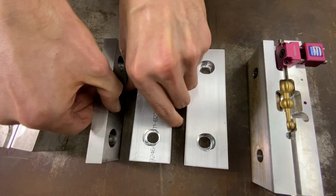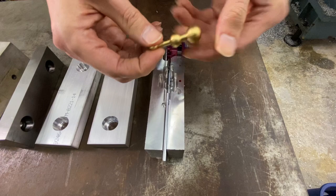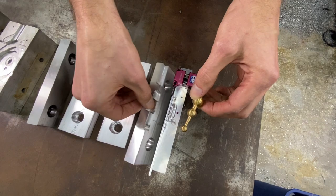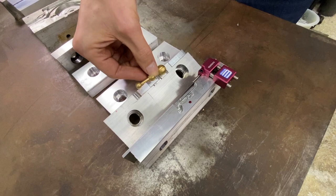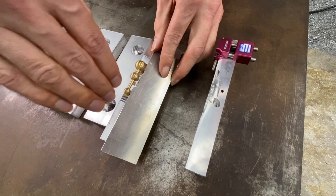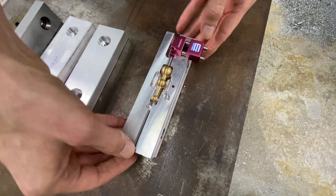Here's another example of a setup for an odd part — a round part with different diameter balls on it where we had to drill holes perpendicular to the centerline through the center of the wall. We made a soft jaw clamping on the large diameter here and the small diameter here. We also made a stepped parallel that sits in here to support the bottom of the part, giving us parallel alignment to the centerline of the part, plus a stop. Another good use of soft jaws — you can make it as complicated as you need to get the job done.